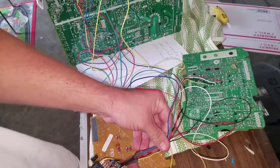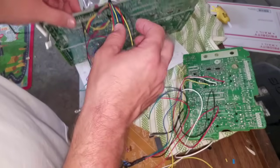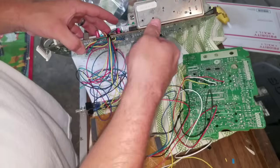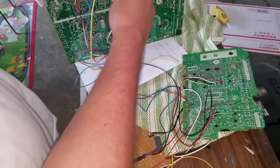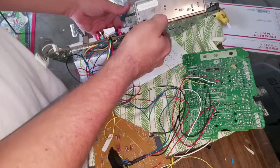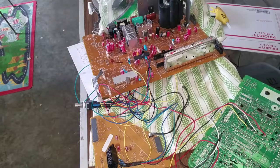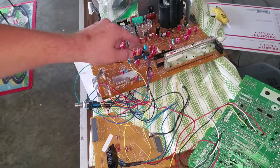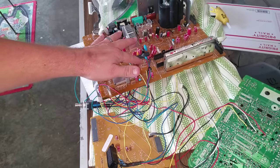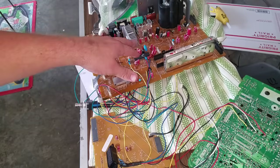So we take our RGB and our second ground line and tap into our main board here, feeding in our RGB signal. If we follow those lines, they come here to the chip on top. There's no secret to this — you have to have that desoldering gun so that you can desolder the four pins on this chip. No matter how much you try, sometimes you still run into obstacles. I had one of the pins on the blanking side just pop right off — it got wiggled, I pushed it out, it came up, and then after I went back and touched it, it just fell off.